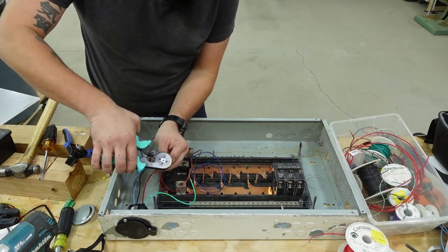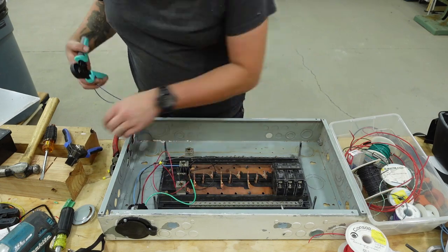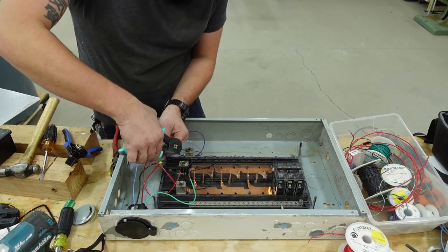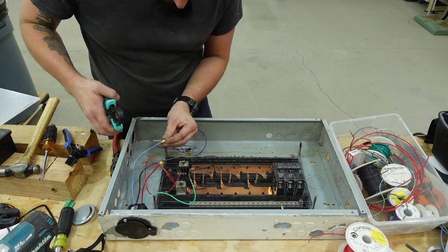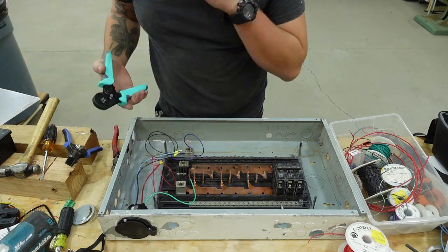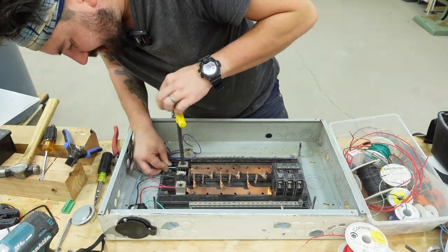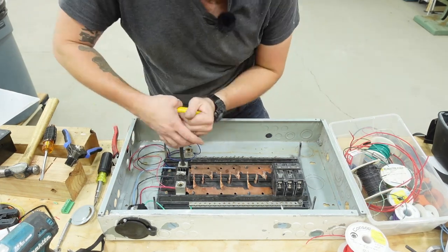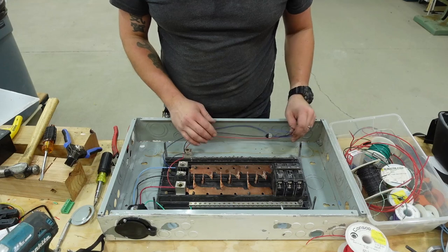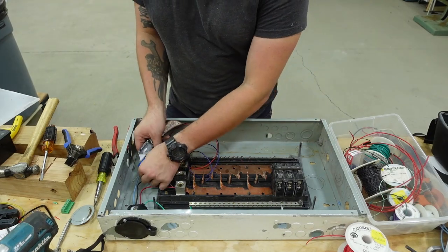I am putting these ferrules on the end of the wires, and this is doing the job of connecting this signal wire to the current wire. The signal wire is going to feed into that control box. Sure, there's electricians watching that are cringing over this, but hey man, it's just electrons. All right, so here we got the signal wires, and we got to get our current clamps. So these are going to go over each leg of the three phase